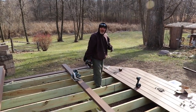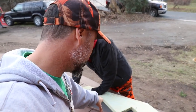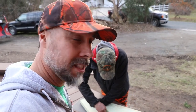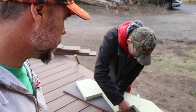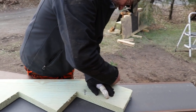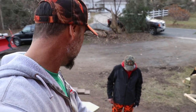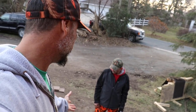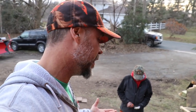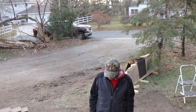Because the end's there, you're going to be able to see the green wood compared to the rest of the deck, so we put a fascia board on the end. Frankie's showing us how he marks it out and then cuts it to fit. Some people use the entire fascia board just as it is raw, but the way we're doing it will leave a better, more finished look. Frankie doesn't like that raw look — it just looks like a hack job.